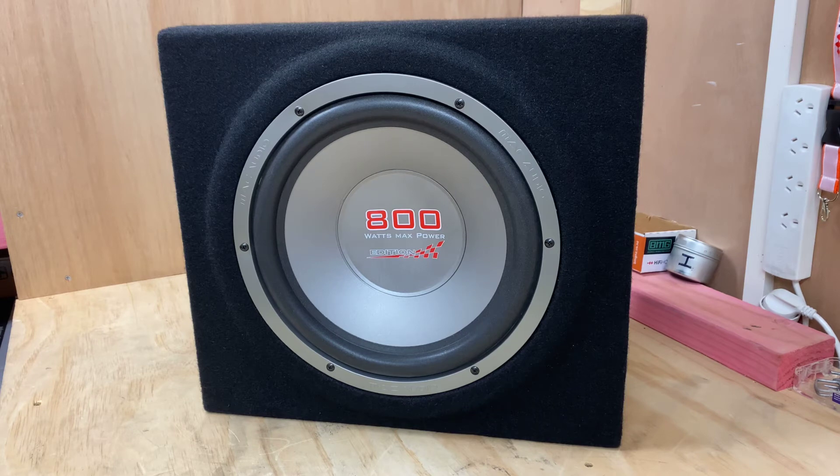You can put the BLK-1000 to power that up, or any little monoblock ranging up to 250 to 300 watts RMS would be perfect for this. It's a 4 ohm load, so you just need an amplifier that can generate around 350 to 400 watts at 4 ohm — that'll power this all day long.